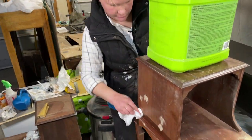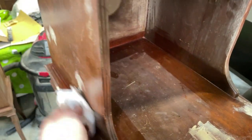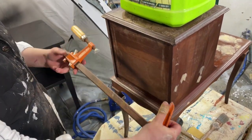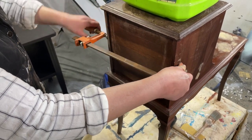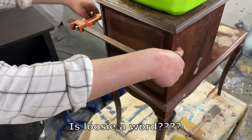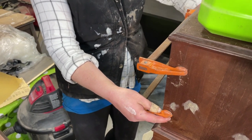I'm making sure there are no glue remnants — I used weight to press it down, making sure there was a nice firm seam, nice and tight. I'm wiping pretty much everything to get rid of any glue excess, since I put glue on pretty much every single seam. I'm using weight to keep the top joints firm, but since we also did the side pieces, I decided to use some clamps to make sure those side joints stay nice and tight — one on each side. Tighten them up nice — be careful, this wood is very fragile, so tighten it firmly but not so tight that you crack the wood. Put the clamp right where you actually did the seams, because that's where the pressure needs to be applied.